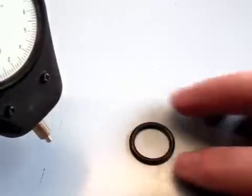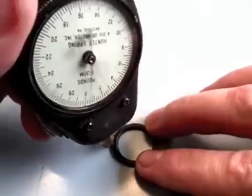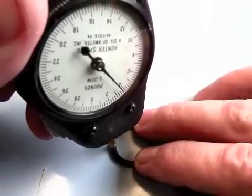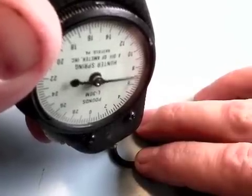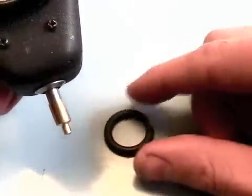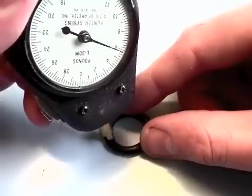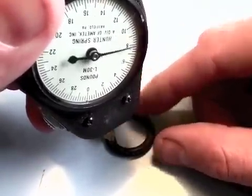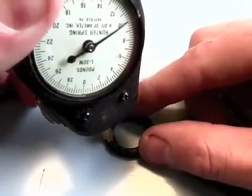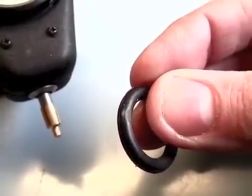Let me move those out of the way. This is the 90, and if I put it on there, you can instantly see that it's quite hard because trying to just balance the gauge on it, it just wants to slip off because it's hard and circular. So that's down at about 10 pounds of pressure. But if we switch over to the one which I think is about 50% and go down to 10 pounds, you can sort of see hopefully that the O-ring has become quite deformed. If I take this off and hold it to the camera, you'll be able to see the dent just there - it's just coming out now where the gauge sat.